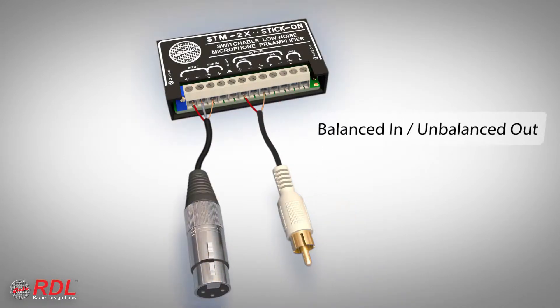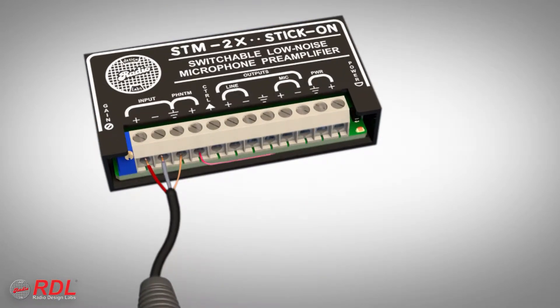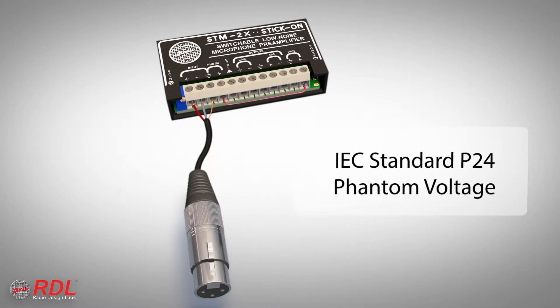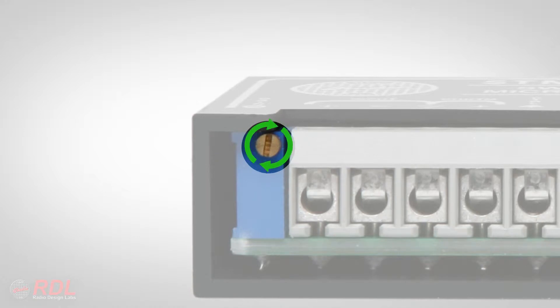The input is usually connected balanced. During installation, connection of a single jumper activates phantom voltage for powering a condenser microphone. The module supplies an IEC standard P24 phantom voltage that powers all compliant microphones specified for 24 volt phantom operation, and most mics excepting 48 volt phantom.